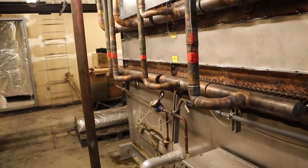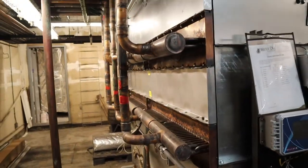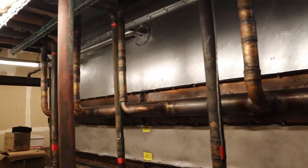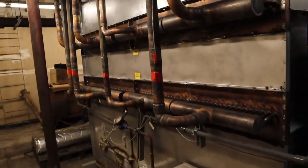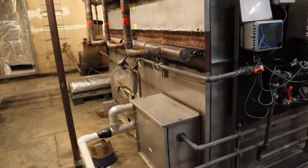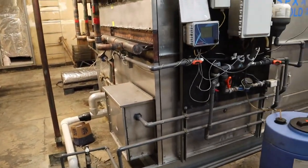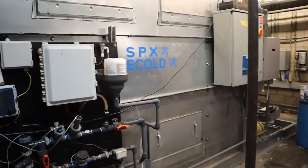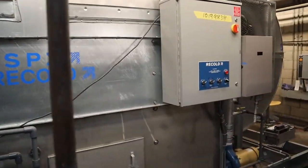A lot of people get stuck at the drive programming. So it takes a lot of years to kind of get used to it and comfortable. But before the programming, then you have to learn the wiring. The wiring is a whole new thing. You have to learn how to wire them first with the bypass and the inverter so they interlock, and people get stuck there before the programming. So yeah, the drive is a big deal.